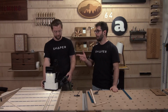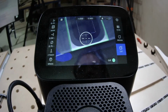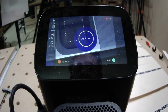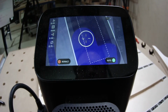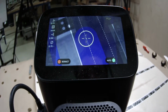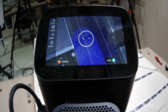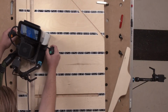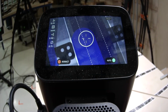We know that the plywood that we have is definitely thinner than 3/4 inch. I'm not sure exactly off the top of my head what this specific plywood thickness is because it's all different. Every sheet that we have here is different by 1/100 of an inch or so. But the last sheet that I used was 0.69 inches, which if you double that up, that's a whole 1/8 inch that you would be off if you assumed there was no offset.